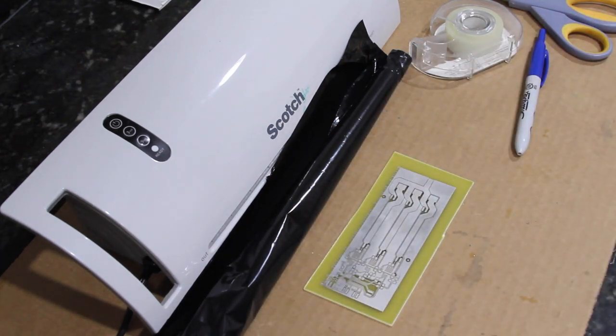I'm going to apply a solder mask, expose it and develop it. Then I will apply solder paste and place the surface mount components. I'll then bake the board in a toaster oven as a cheap reflow oven. And finally, I will hand solder a few components.